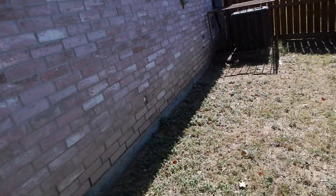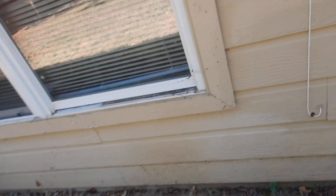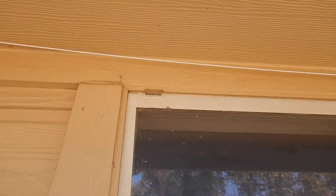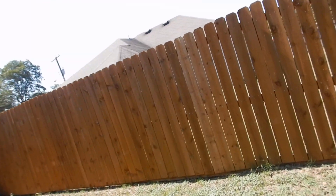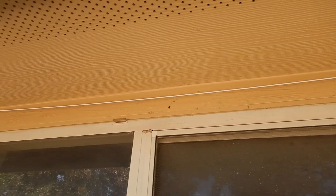The gutters are still not diverting water far enough away. We've got a whole video for the air conditioning system. Freeze boards are still rotating out of place a little bit. These windows are a different style than those windows. The sash is fine — this is a side-sash window. See those little squares up here? Those are weep holes — they drain. Any water that gets into the wall around the windows should leak out through them. But it can't, because the window has been installed upside down. We've got upside-down windows.